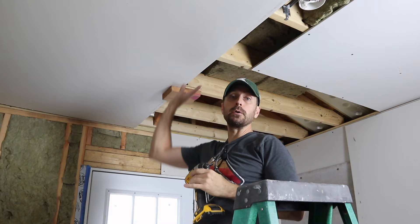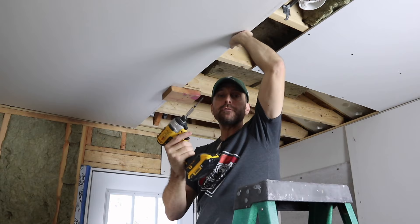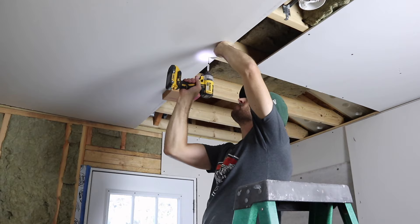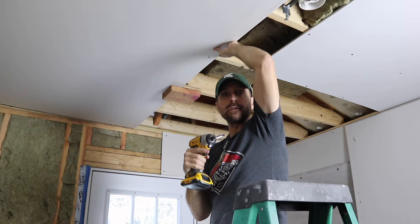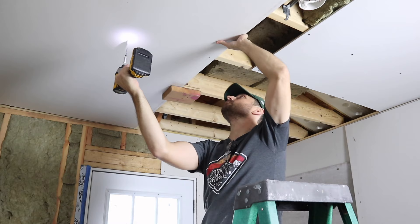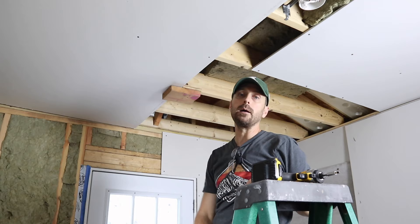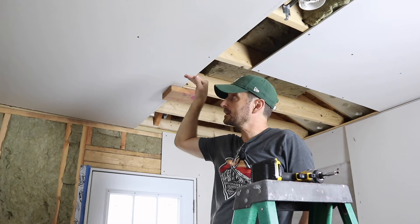I have put these sheets up without these locking clamps — it's not necessary. When you walk it up, if you have your drill pre-staged with some drywall screws, you can screw them in. If your ladder is staged properly in the center, you can reach at least four ceiling joists, plus another foot and a half to get another screw in there. A full eight-foot sheet will hold with four to six screws no problem. Just make sure before you put those screws in that you slide it back and forth to adjust it so it sits square and flush against the walls.